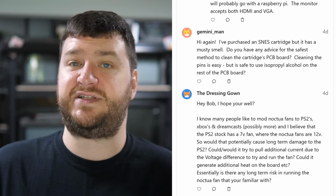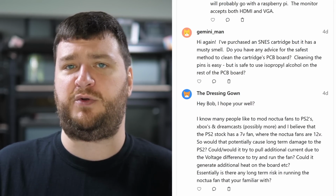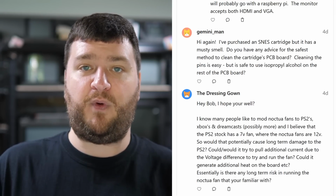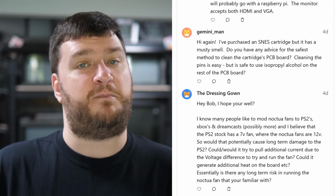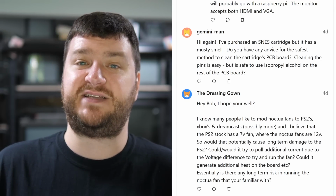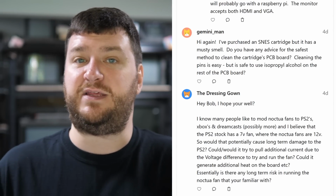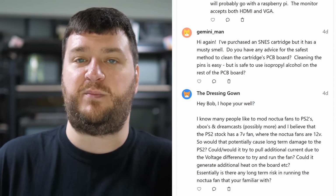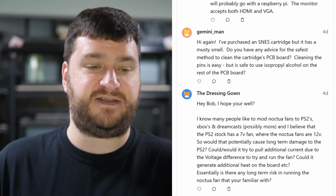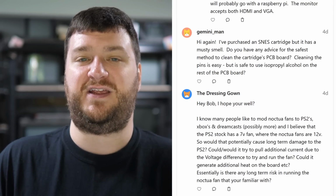And I just even recently had somebody say that they did it years ago, and their boards are fine, so they don't know what people are talking about. That board will absolutely someday die as a result of that. Most of the time it's within months. Sometimes it takes a while because maybe you got lucky and the impurities stuck to the spots that don't corrode that easy, but it definitely is not a good idea. So I know that's not what you said. I'm just saying it for the context of people listening.